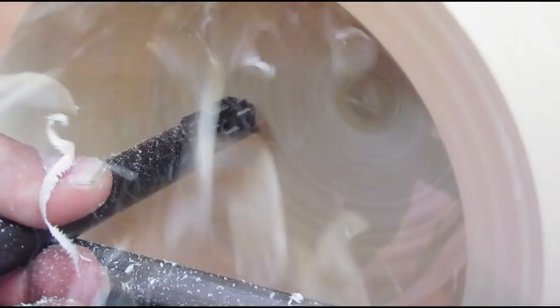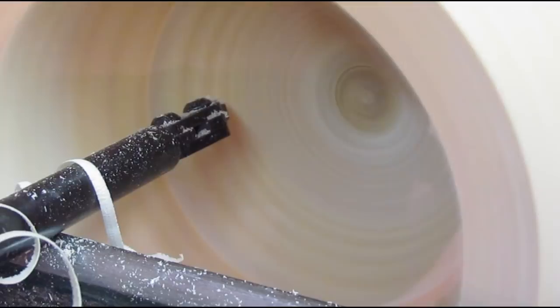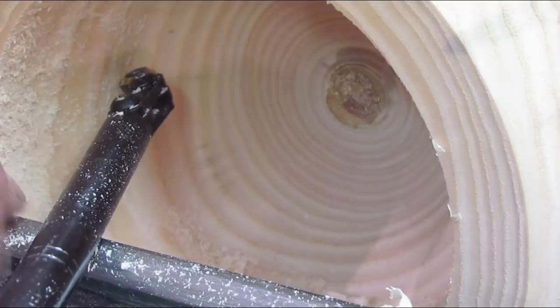Don't need to fight with it. Take fine cuts. A little bit of judder there — that's because the cutter got quite aggressive in the overhang. So I just rotate the tool over a bit more and take a finer slice to lessen the forces. I also need to move the handle around to keep this cutting edge as perpendicular to the surface as I can.